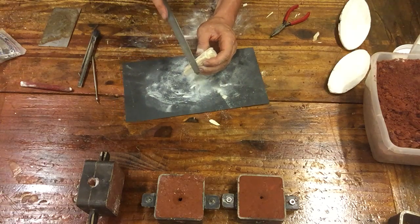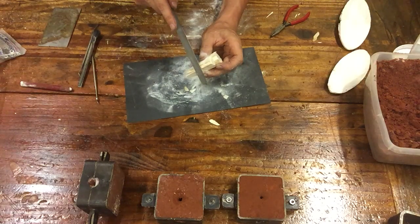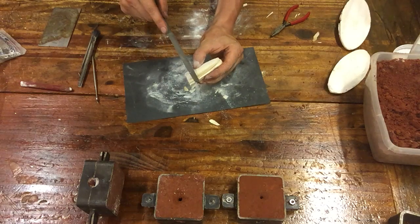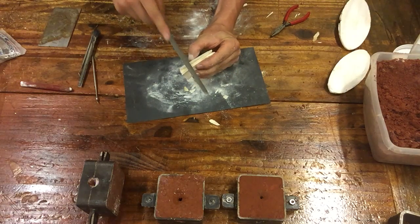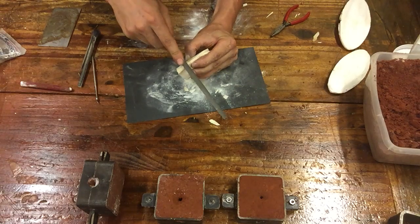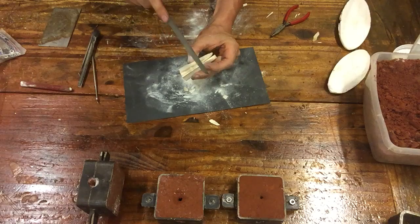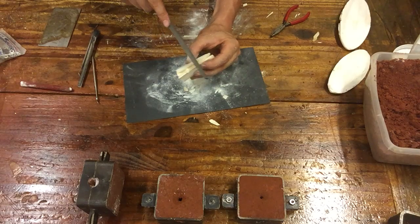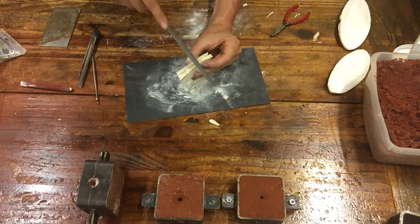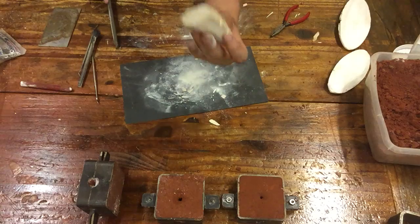You want to go slow enough to where the keratin doesn't just shatter away, but gives you something to hold onto. I'm still holding the whole part together, cutting my registration. That lovely sound — it's like I have a parrot that wants this cuttlefish. We've cut our registration in completely.